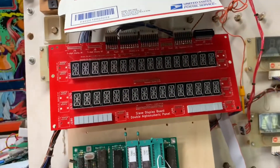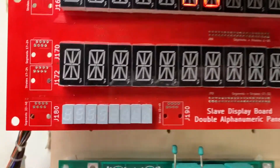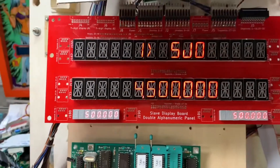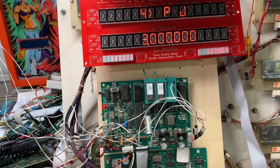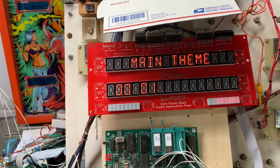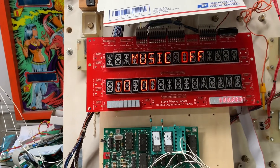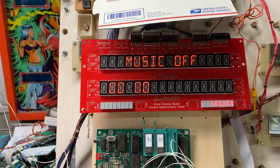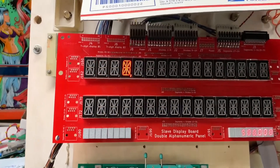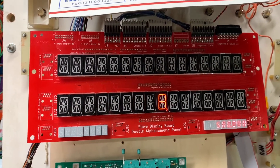Let's power up — you can see I have spared no expense on a shade for the display. The first thing you notice is that segment A is lit and the middle segment on the five is operating properly. Let's put it into test — music test, and all this is going to come from the CPU board itself. I love Taxi; I've never owned one but I'd sure like to. Let's go to the next test, which is display test — that looks much better, doesn't it? Taxi has only numeric displays on the bottom.